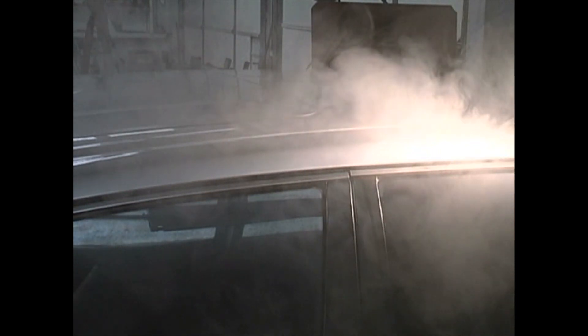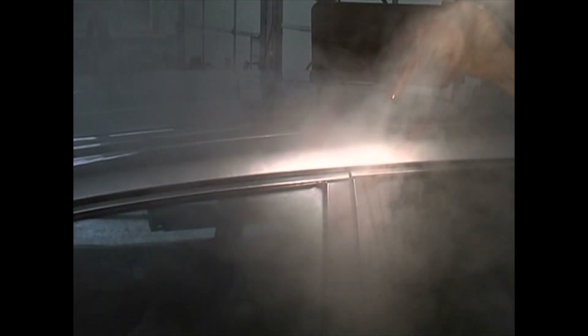Move the smoke around the area where a leak is suspected. Hold the smoke a few inches from the test area and search for the disturbance caused by the leak. Now mark the area and make the repair. This test must be conducted in still air — you may want to close the shop doors for this one.